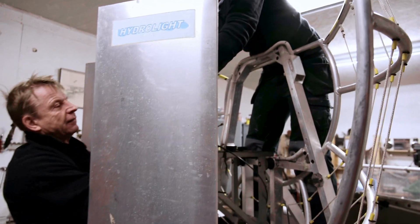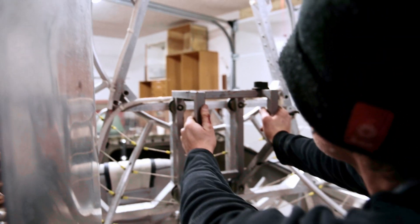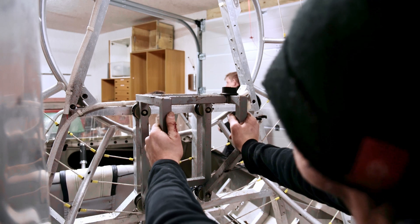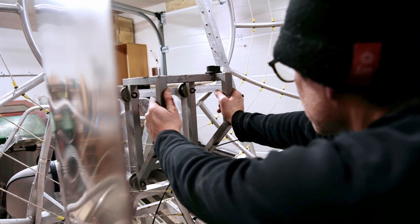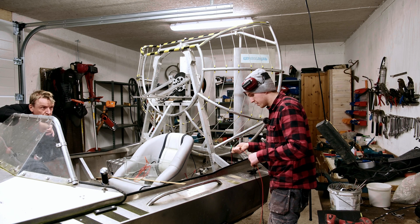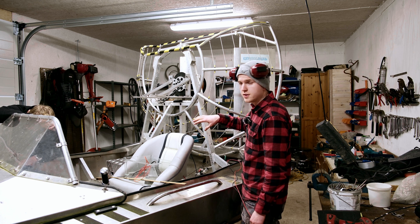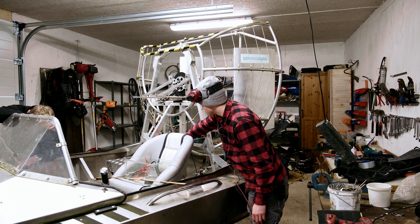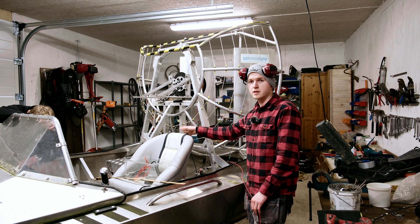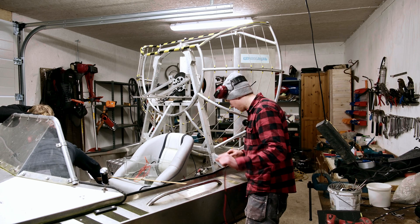That's what was in it and this is of course what's going in it. We've been fighting these old motor mounts for a while — it's a rubber one, almost all off. We've managed to get the old 12 volt system out of here — just a few cables left for the lights, which will be cleaned up at a later date. We've decided to put the ESC box mounted here, so it will have plenty of cooling and be hidden behind the seats, and then the bus cables are going to run to the batteries down under the seat.